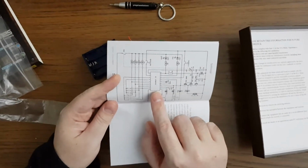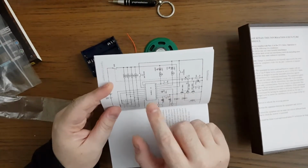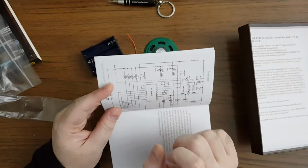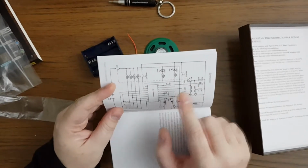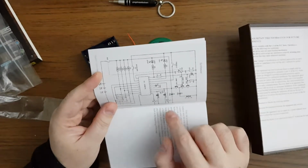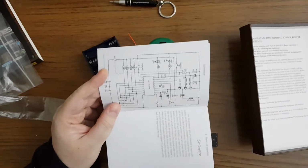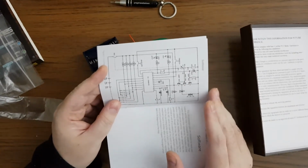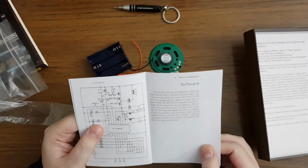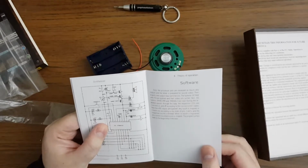Keys go into the processor, output of the processor on pin 18, flashy lights, the envelope control goes into there. There we have the pot to actually set the volume. The octave goes in there. The flat button goes in there, but given we have no idea what's in there, although we could work it out, I mean, we have one page of software which just says the very basics of what the processor does, but doesn't say how it does it.